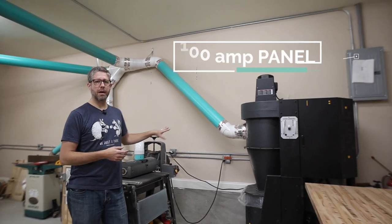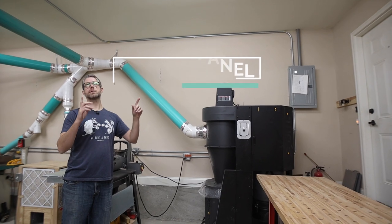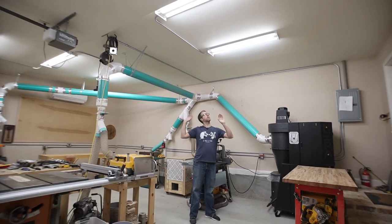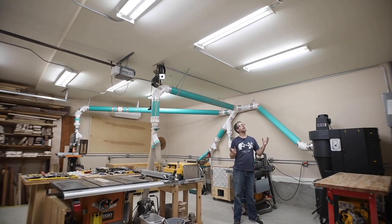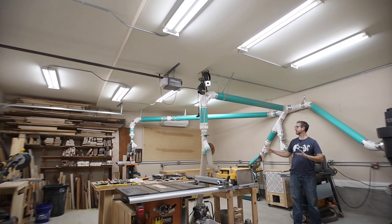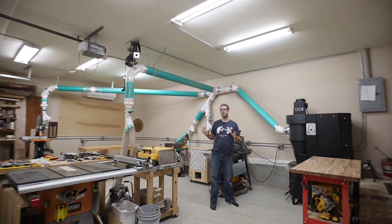At the time I had the panel and wiring done, I had the electrician upgrade my lights. He daisy-chained a bunch of them together — the garage previously only had two. They are T8 standard fluorescents; he bypassed the ballast and now they're LEDs, and he added a bunch more in here. That's why it's nice and bright. They're quiet, they don't hum, and I've gotten a lot of use out of these lights.